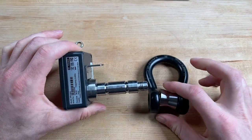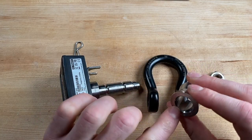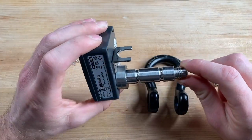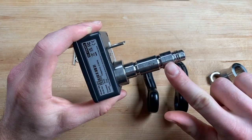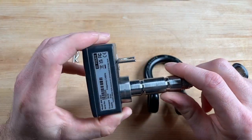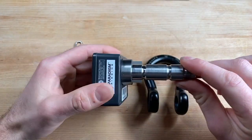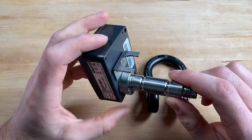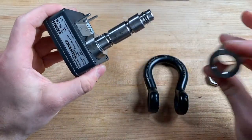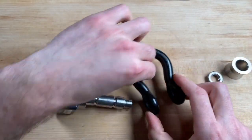When we pull the cell apart, we're looking at the centering bobbin. We're looking inside to make sure it's clean and intact — no gouges, excess dirt, or anything like that. The load pin: we want to make sure it's clean. You can see a little bit of residue of dirt on here, so we'd take a lightly damp or dry cloth and wipe it, making sure it's smooth and clean with no cracks, nicks, or gouges. Our pin is looking good and our bobbin is in good condition. We can inspect inside the rest of the shackle bow and make sure no damage is noted.